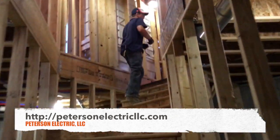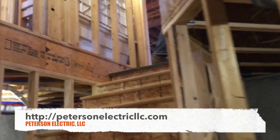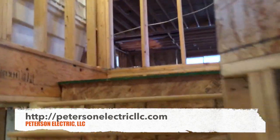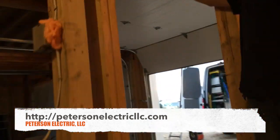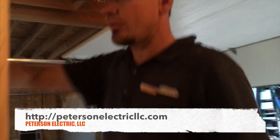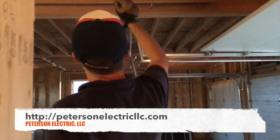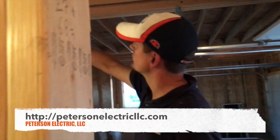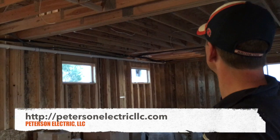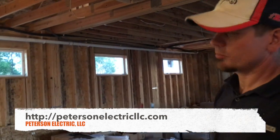They put an office above the garage — it made it really difficult getting all that garage drilled out. We ran a 14-3 to the garage door plugs and then a 14-2 over to control the lights for the four LED strip lights we're putting in.